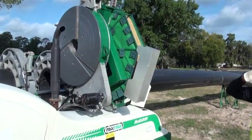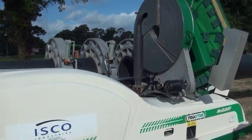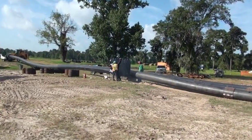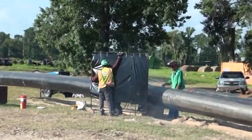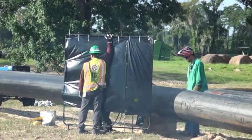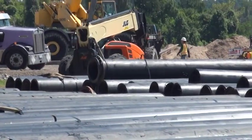The large HDPE plastic pipe is fused together using a heavy machine that heats the pipe up to over 400 degrees and then pushes it together so that it welds and is basically fused. The machine pushes it out and then adds another length, and they just keep going until they have at least 1,000-foot lengths.